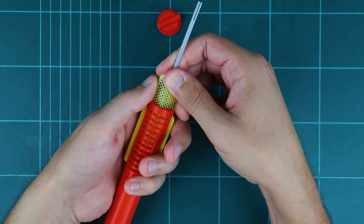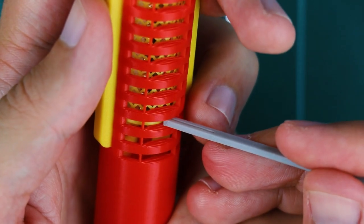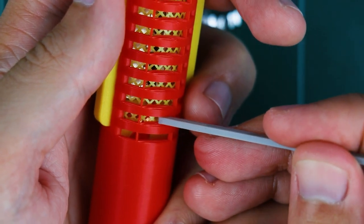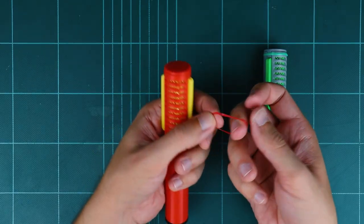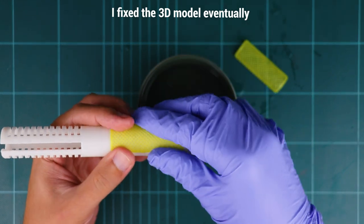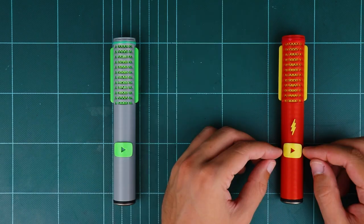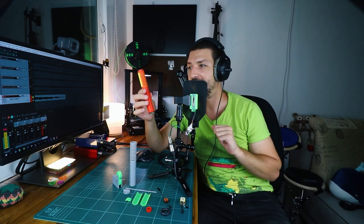Also, until making this video, I used to slide the pop filters after the motor and close it with the cap. But the pop filters sometimes get stuck on the slots if the mesh is too thick or wide, making it hard to assemble and even opening up the grills. So the funny solution would be to put a band on the top, but the most convenient is just to print narrower pop filters, pre-bend them and glue them in place with a few drops of super glue on the edges. And that's it, you have a ribbon microphone and another ribbon microphone.